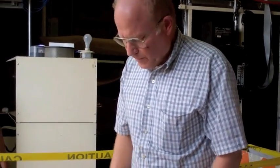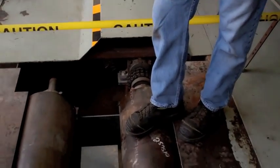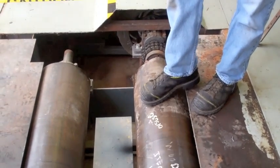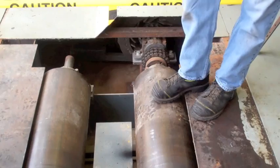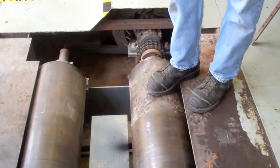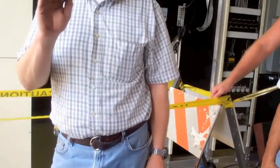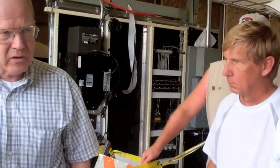Other than that, this is a much bigger dyno than you see normally for cars. It's much bigger and heavier and will handle a lot more power, and therefore it has a lot of inertia. It can stand a lot of weight. In doing a test like that, what you want is a steady state condition, which is difficult to get in cars that are going to get hot, because you don't want them to just sit there and run. But if it could sit there and run for 30 seconds while you hold a given brake torque on it, then you know for sure what you got.